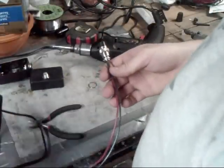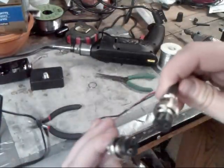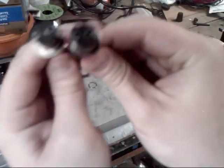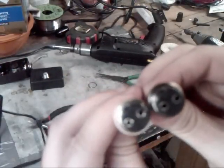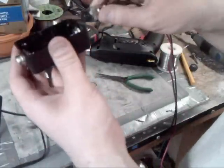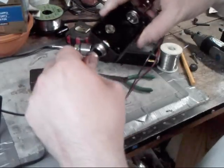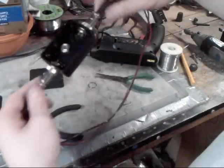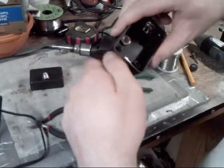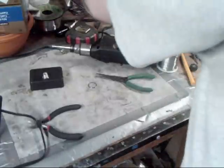Let me shut my soldering iron off. Let's see if I have this lined up right. If you have this done right, your positive and negative — these two plugs should be identical. The left should be positive and the right should be negative. You can test this with continuity on a multimeter. This is my project box — this is one that I finished already. If you have everything in tight, it should fit nice. That's the two ends, and that is how you build your wires for this. This will allow you to bridge your panels together and eventually run one big wire up to a junction box where you can put a string together.